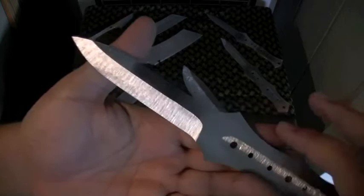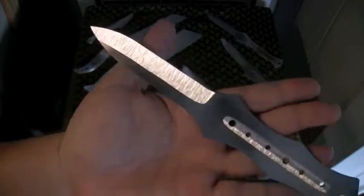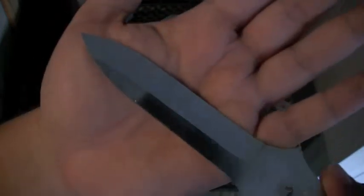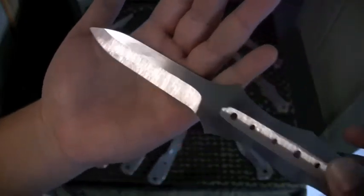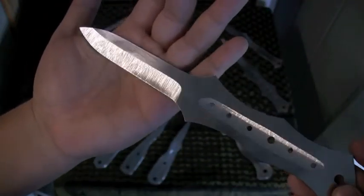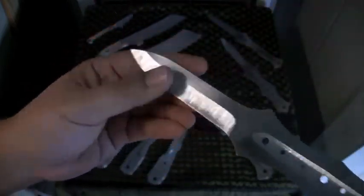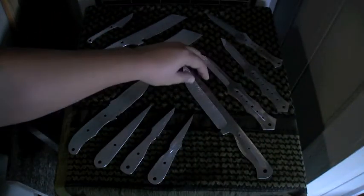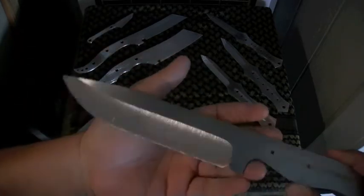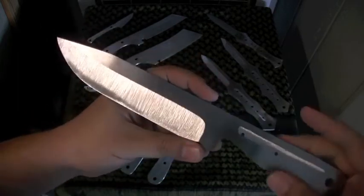the rest of them I made this regular style hollow grind, just super clean. This is I only did it with a 60 grit, so I gotta take it down to probably 220, smooth it all out, and I'll be sending it out for heat treating. So still got some little imperfections on the grind that I gotta clean up. So actually kind of ran into some problems with my grinder. The flat platen I had was not flat, so it's really giving me a hard time. So luckily I got that fixed, and I've been pounding out work ever since.